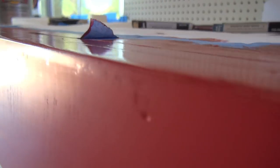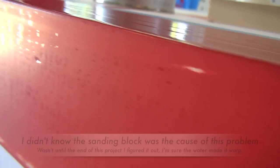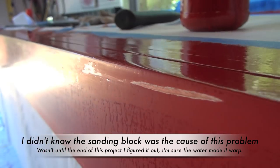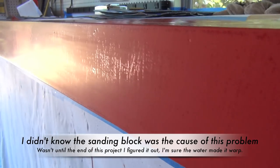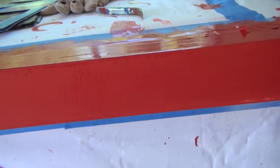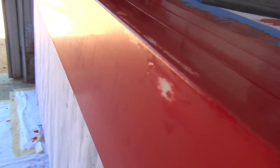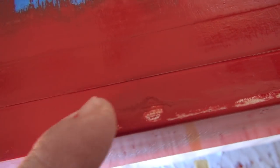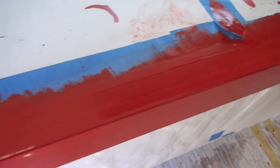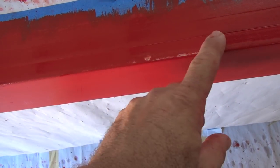You can see that it's definitely better. Here's one of the nail holes — I should have filled that in better, but that's okay. It's a workbench. You can still see after I wet sand it's not all the way down, but it came all the way down to the primer in a few places. Those are just high spots, so don't worry about that — it'll cover up in the next couple of coats. Now that I'm getting closer to my paint mixture being 50/50 — 50 mineral spirits and 50 Rust-Oleum — it's starting to lay down flatter and going down smoother. There was a blush finish on one area on the top; I think I got some mineral spirits on there when mixing and it dropped and sunk in, so I decided to take care of that now with a couple more coats.